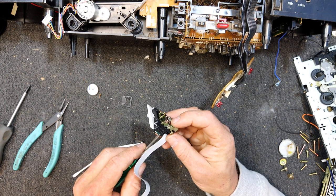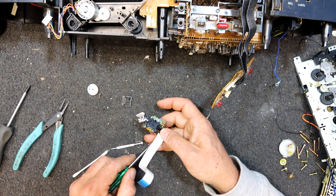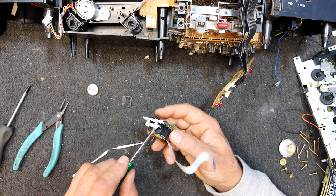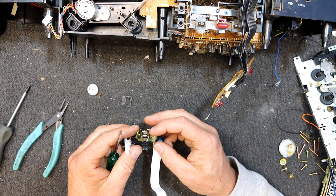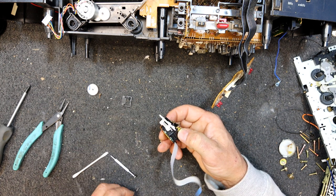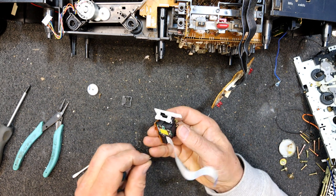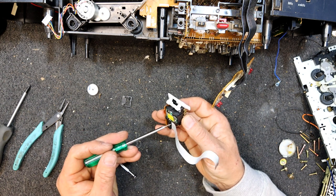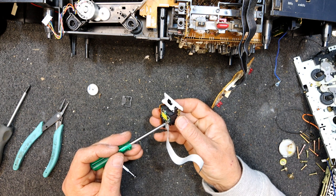Well, that's not going where it should. Look at that. Oh, well, probably because I've tightened the other one up too much, maybe. Looks like this thing, you can actually see it pivots in a little. So that's what the spring's for. Probably I've tightened that one up so much that it's pivoted all to one end. So there is some sort of slant on the lens versus the prism, I guess. And thus the lens versus diodes or whatever. So I don't know how you're supposed to set that up, or if they even tell you anything about it. Usually it's just done in the factory and left.